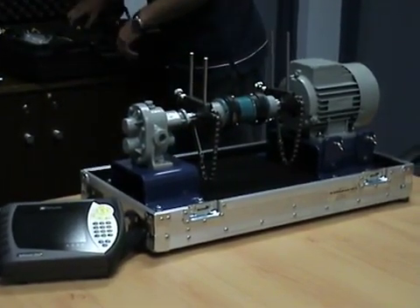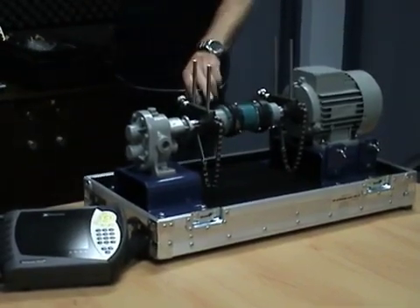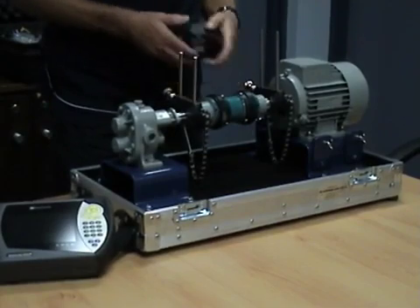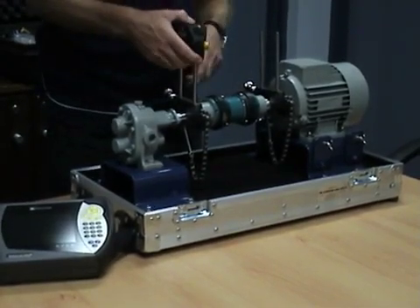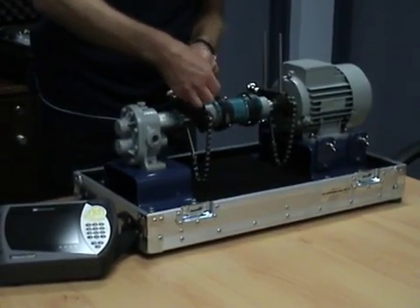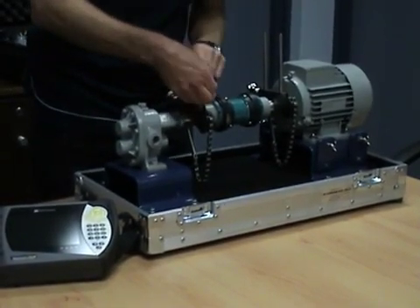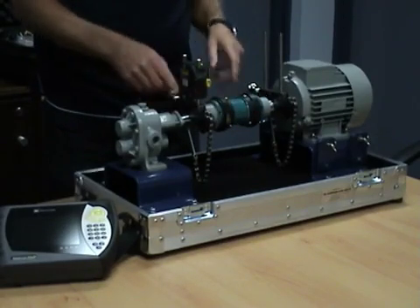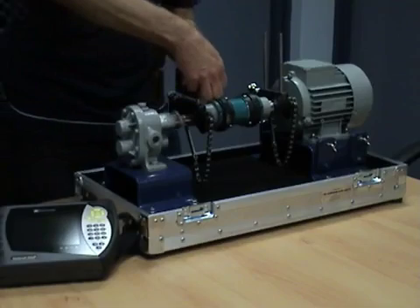Our brackets can be mounted on either the shafts or the coupling. What we're trying to do is make the shafts collinear during operation. Whether we're mounted on the coupling — this is the movable element — or on the shafts, that's perfectly alright.